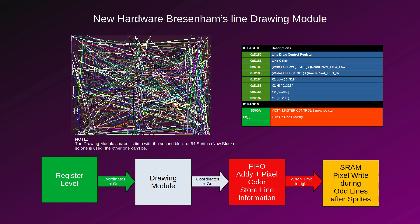And now the crown jewel — another one that's been on my mind for quite some time. You will now be able to draw lines and the core will take care of it for you. Just enter the coordinates, the color of the line, and go. The core will compute all the necessary points and put the address and color information inside a FIFO. Then, when the time is right — whether during blanking or any other appropriate time — the FIFO will be emptied and drawn into the bitmap layer of your choice. Be careful though, because that thing is fast. Very fast.